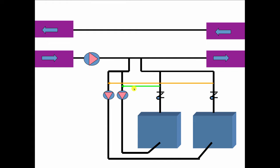So these are bypass lines to bring the temperature of the return up to something higher than 140 degrees. The check valves are there because without them, if the primary is on, you're liable to get this. It'll come out of here and go this way, backwards to the off boiler, and you'd be circulating through here. So the check valves prevent that from happening.